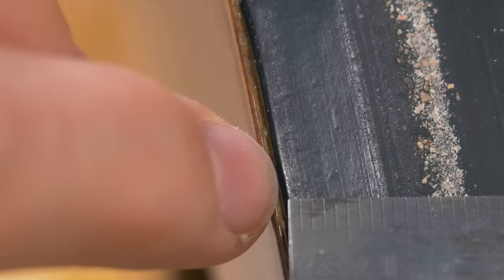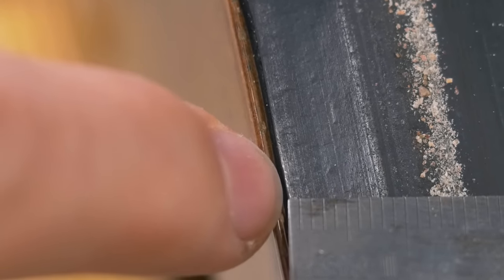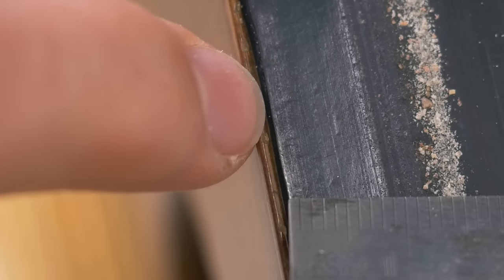To check the wobble, you have to look at the inner edge of the wood here because that's where I turned the channel when I made the wheels — the outer edge won't be true. That also looks pretty good, which means changing the bearing didn't make anything worse. So now I will change the other bearing, and since it's the same process I won't show that.